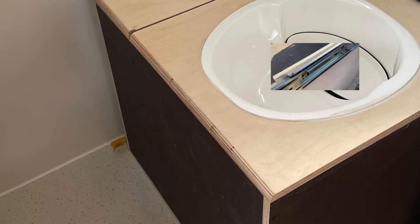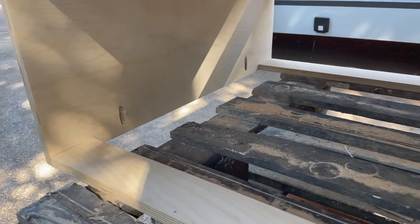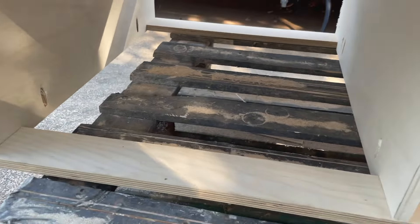To support them we added stretcher bars underneath, which also provide a front lip for our drawer fronts. At this point I added pocket holes to the bottom of the unit just for an extra securing point later on. We then needed to attach some plywood strips to act as runners to the drawer runners themselves — first attaching some double-sided tape, then screwing through after adding pocket holes.